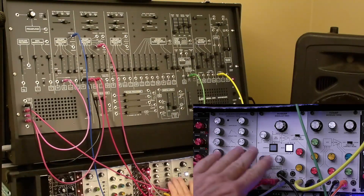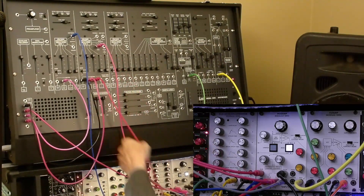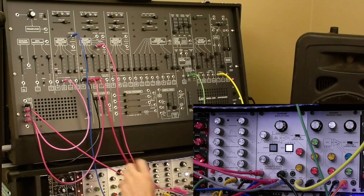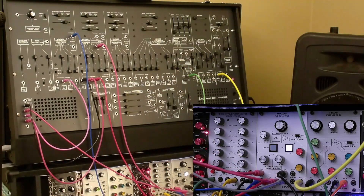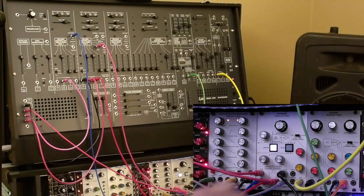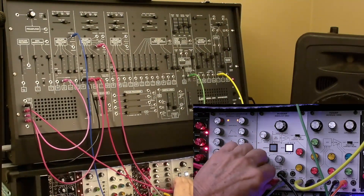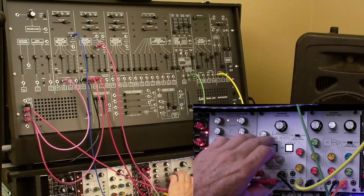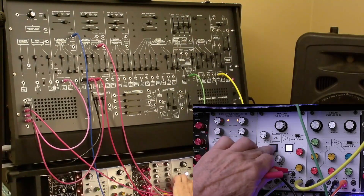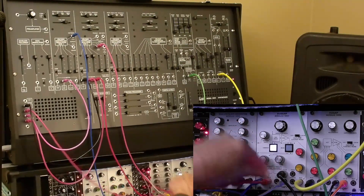Those are the fundamentals except for this section here, and that's where it gets a little bit complicated. One of these will control only VCO2, and one will be routed to both VCO1 and VCO2. I've got it precisely set up so that it will be in tune as we switch between mod and unmod. If I took out either of these precision controls, then it would no longer be in tune as you switch between the two. That's the function of these two knobs.